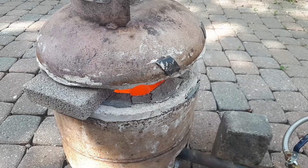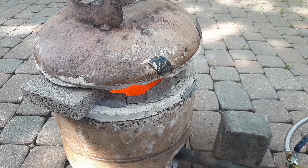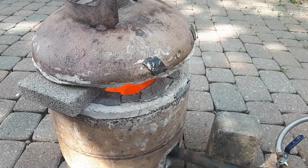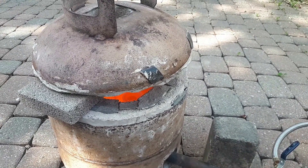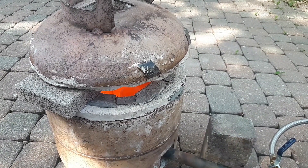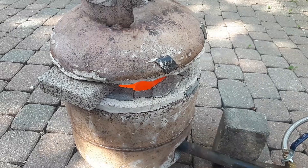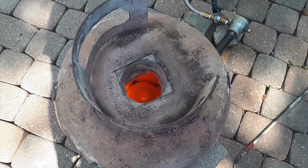I've turned the gas pressure down a little bit to leave more oxygen in the furnace. It's certainly oxidizing the surface of the lead much better now. The difficulty with a gas furnace is it uses up all the oxygen inside, leaving less to react with the lead to create lead oxide. But now with it cracked open and turned down, I can see it oxidizing the surface much more. Getting smaller, slowly but surely.